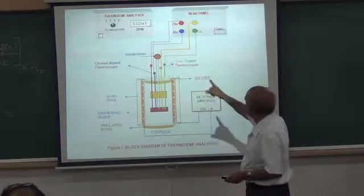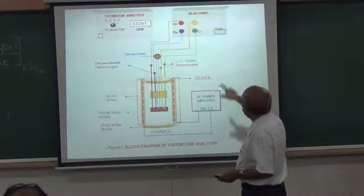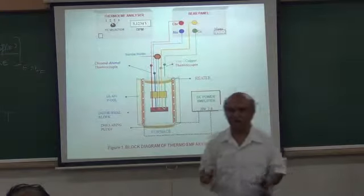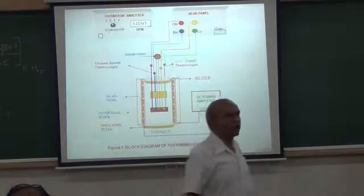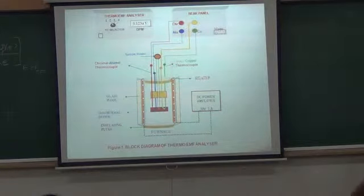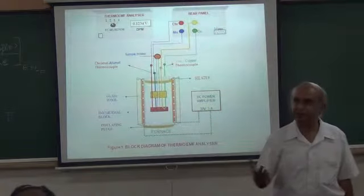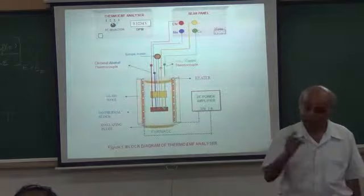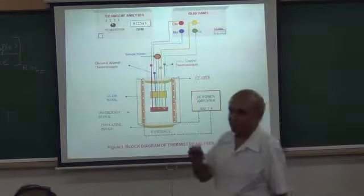I have got one more experiment which I have come to. At the back, I have got the same equipment, like the thermo-EMF analyzer. It's an electronic system. All thermoelectric voltages are low-level DC voltages. As I told you, in all metals, typically the sensitivity is 10 to 20 microvolt per degree centigrade. So you must measure microvolts accurately.